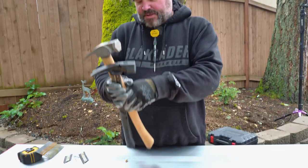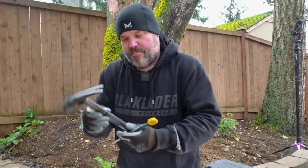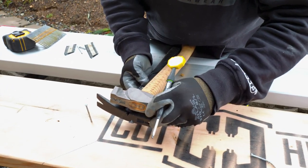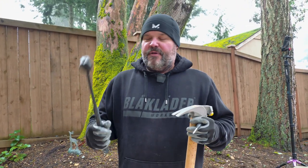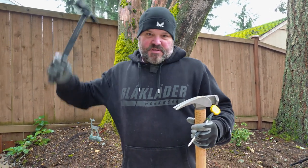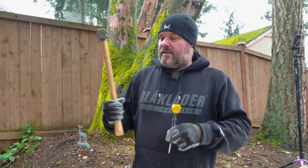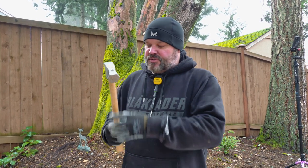The handle on the woody is really long — it's probably two inches longer. We'll use the handy inch markers to check: it's two and a quarter inches longer. I feel like the titanium handle is plenty long — sometimes I choke up on a hammer and use my wrist versus swinging with my whole arm. The sweet spot on the woody is a little lower, so this is really true framing style. Even though it's a light 14-ounce, a lot of framers would appreciate the longer stroke.